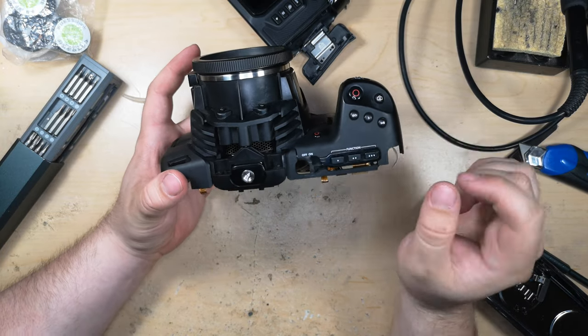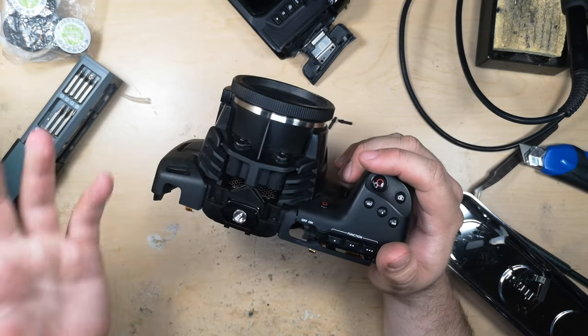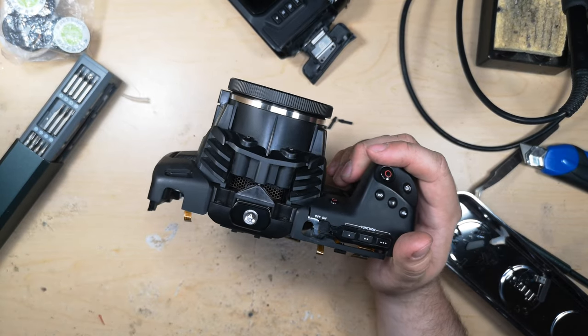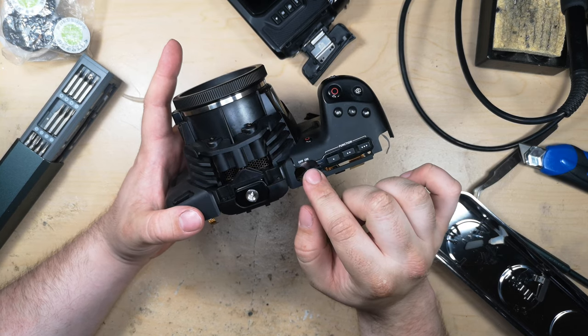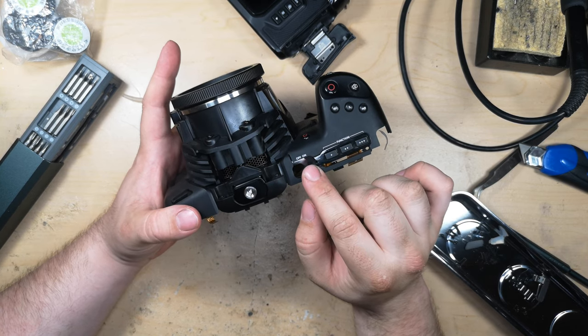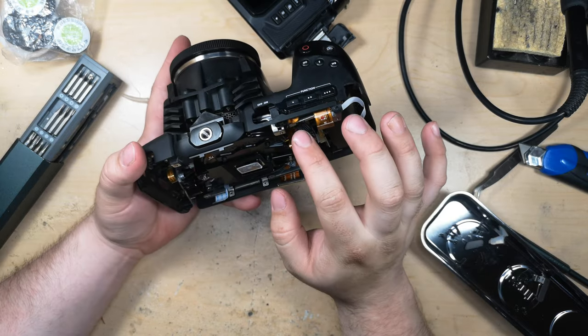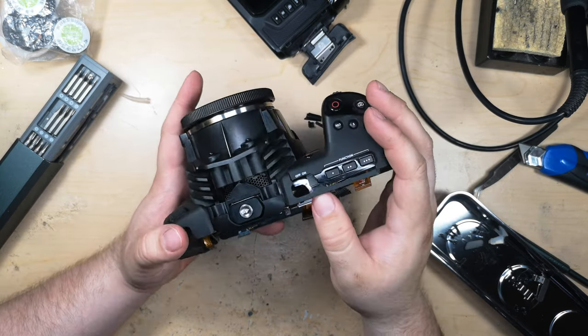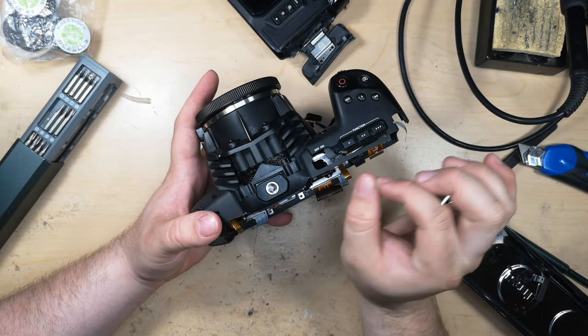So, like, on the inside of a multimeter, the big rotary switch has leaf springs made out of steel or something. Or, like, nickel-coated steel. It looks like the slider switch on this also had that same mechanism. So when you pushed it in, it slid those. So it's not like there's a mounted PCB or mounted flex PCB switch here that I can slide and turn on.